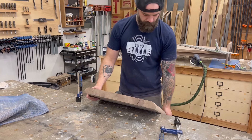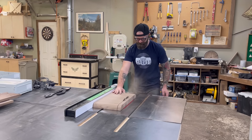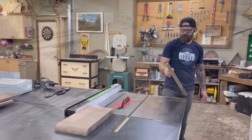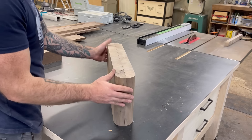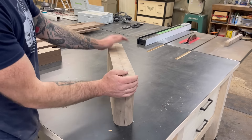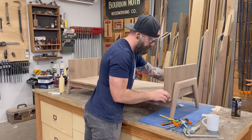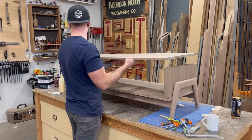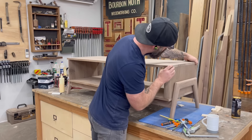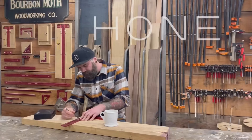With both ends of our solid stock shaped with a nice rounded profile, I take them over to the table saw and I cut out my two individual end cap pieces — the height on these is right around nine and a half inches. When you put both pieces together, it's pretty close to what we're going for. So don't always rely on those router bits — just get your creativity cap on and start shaping things the way you want them. With those pieces cut and shaped, I put them in place and set the top on just to make sure this was actually looking like a coffee table. The bad news is it looked exactly like a coffee table and we're making a whiskey table — which means we really screwed up somewhere. We'll fix it.